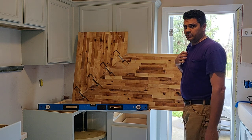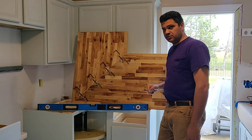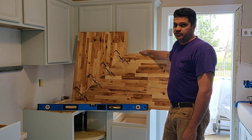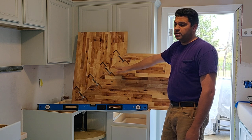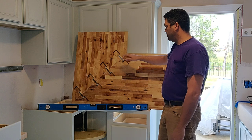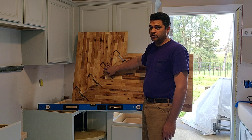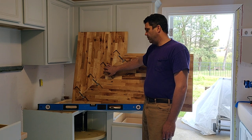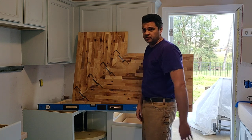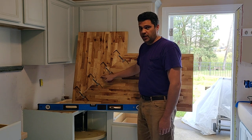I'm an experienced licensed builder. And I think if you have just flat spaces, then you could totally do this countertop installation yourself. However, if you've got a 90 degree turn that you've got to put in, you need to hire a professional, because I had to pull out a lot of different tools in order to make this one simple 90 degree turn. I guess you could butt them together, but it just ain't going to look professional if you just butt the two slabs together. So what you end up having to do is cut two perfect 45 degree angles.